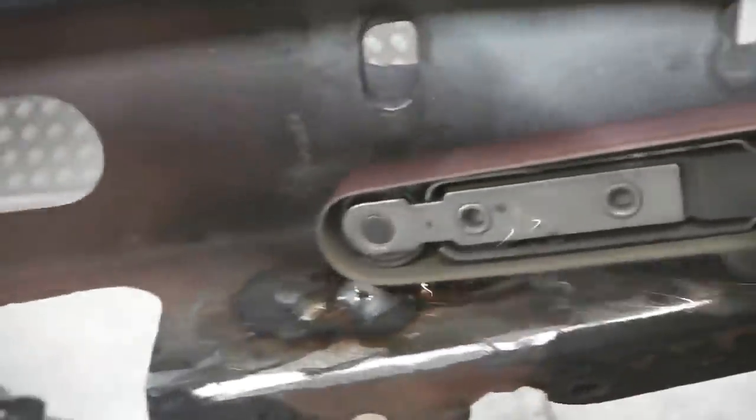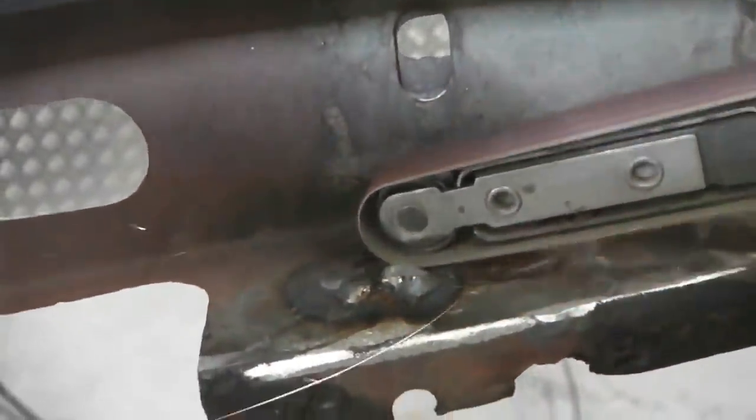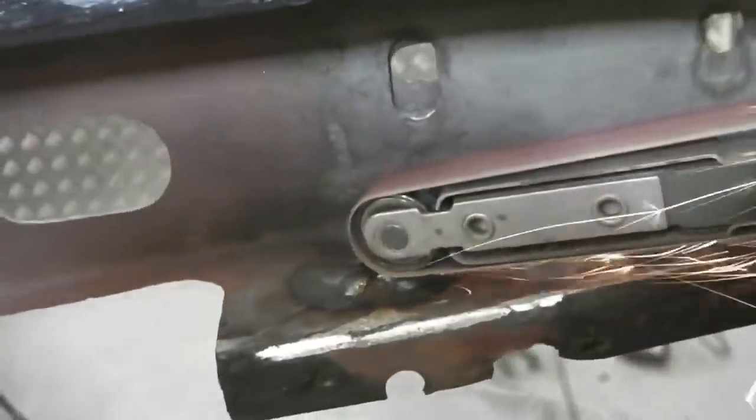Needle file in, finger file, sorry, I'm going to get that right. That's the finger file. You'll find for one operation that will use the entire belt, so you need loads of belts. I mean, if you're going to buy them, buy a big box full, because for that nugget that we're grinding there, that will do at least two or three belts, would you believe? Sounds crazy, but it's true. Depends on the type of belt, actually, the quality of the belt.